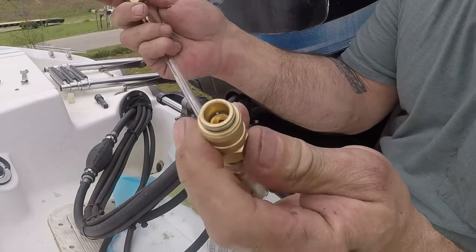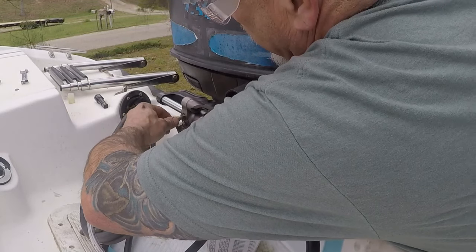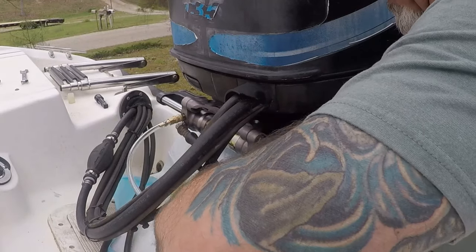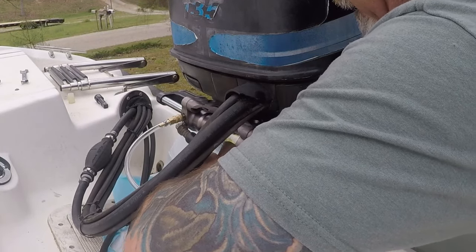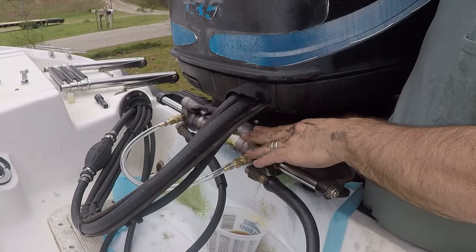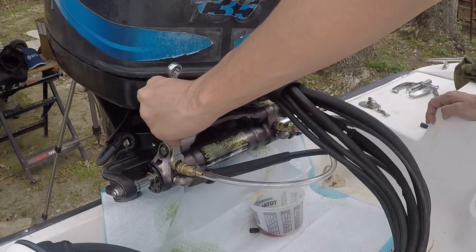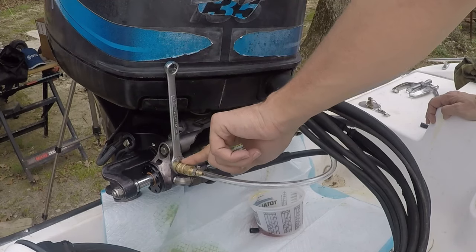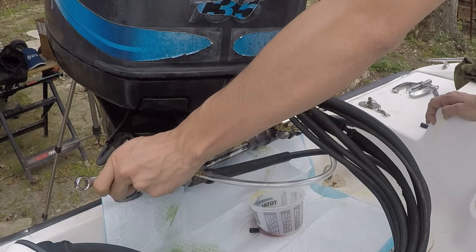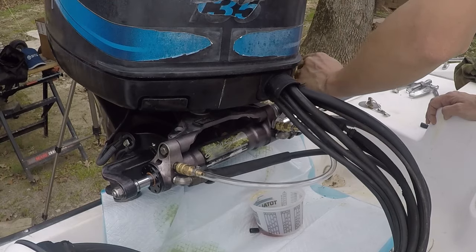Here's what I've got — this is one of the tools available from Marine Tech. What we're going to do is hook these up and put one on the other side. We're going to purge each of these cylinders of air. To do this, open up those valves by a quarter to a half turn. You can see us doing that here — getting a quarter turn on these, maybe a little bit less, but a quarter to a half turn will do it.